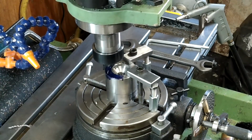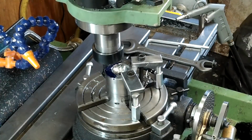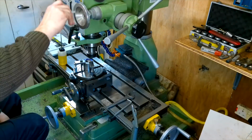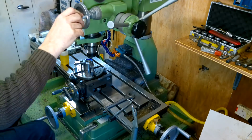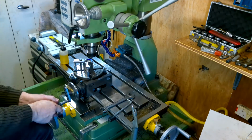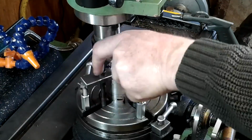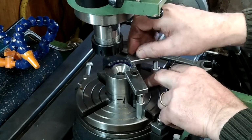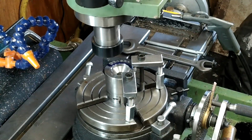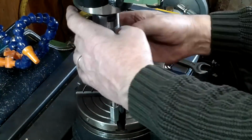I'm going to use a 4mm carbide drill to make the holes, but to ensure they start off on the right foot, so to speak, I first went around the top face with a 4mm centre drill. That way I've got a fighting chance with the drilling operation of drilling the full 35mm depth straight and not popping out of the side halfway down.